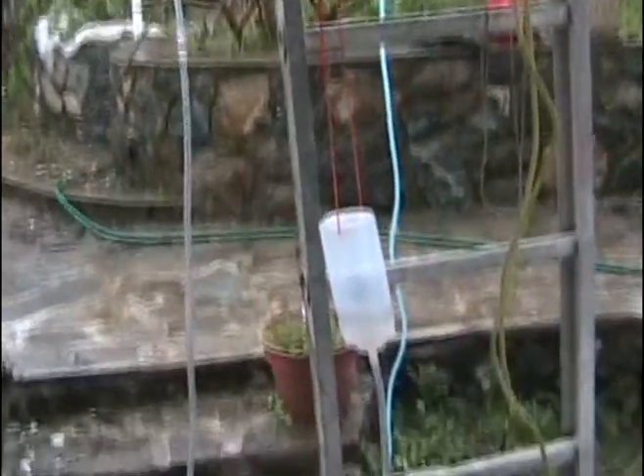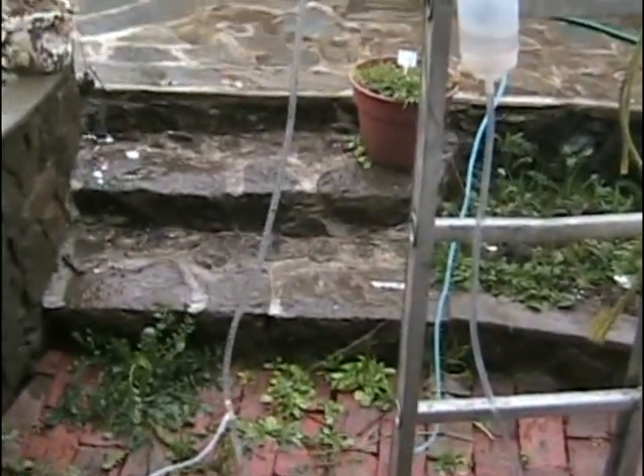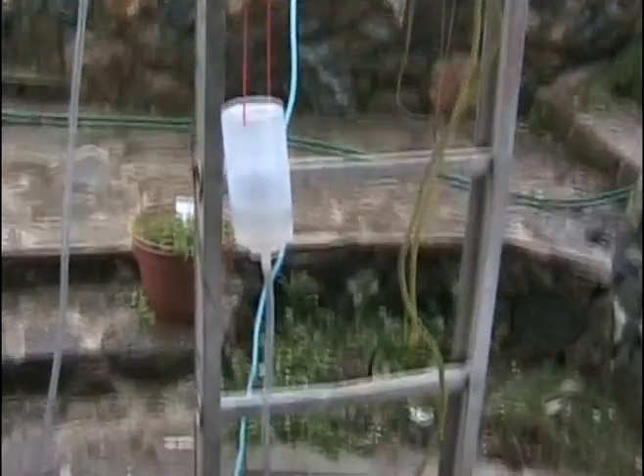There's a clear pipe here — that's how high it's pumping. That's less than two feet, and with those little pipes it goes all the way to 13 feet high. That's 22 inches of submergence, pumping 13 feet above the water level.